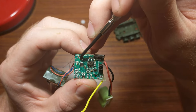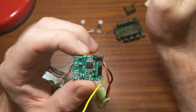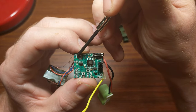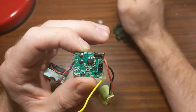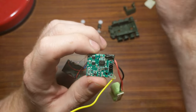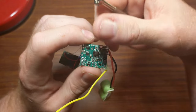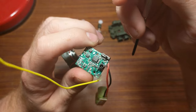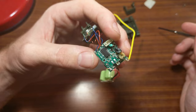These two little packages might be snubbing diodes, but that wouldn't quite make sense because the motor is reversible — so they're probably caps to help reduce voltage spikes in a different way. The rest of the active silicon here could be more transistors or potentially a regulator, and there looks like a protection diode as well, but it's hard to say for certain.